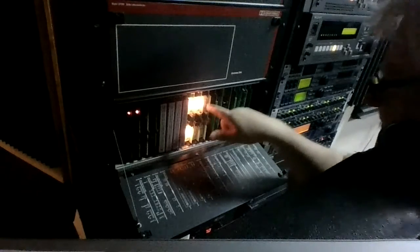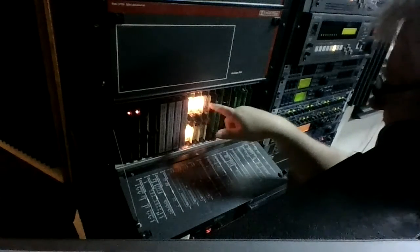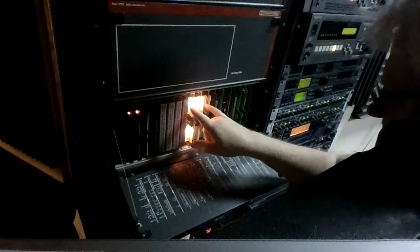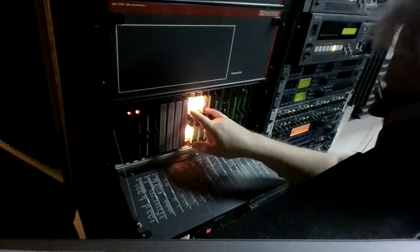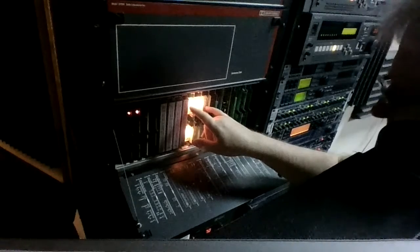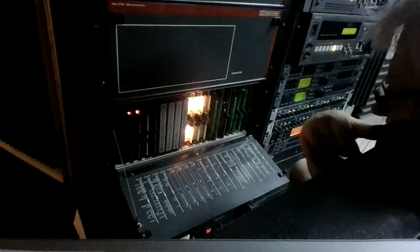Actually, I have swapped these meter filter cards around, and one seemed a little bit higher than the other, but still this level here, because it's playing Dolby tone, I don't know why that tone is a little bit high. That should be a little bit lower down. That should be several dB down. It's a little bit 2 dB high there.